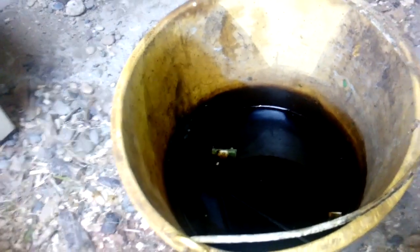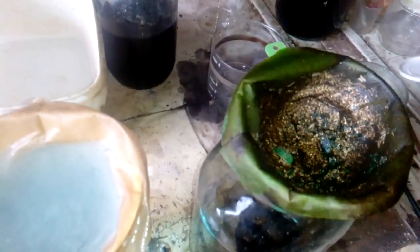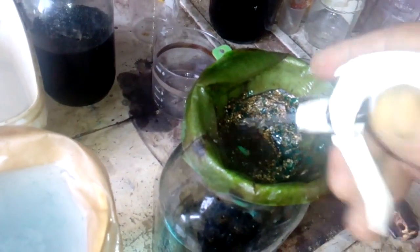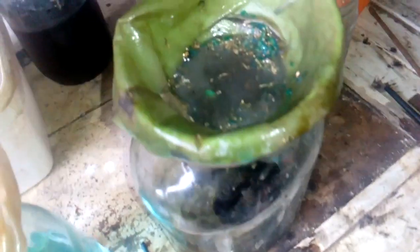Okay, I'm gonna finish. We filter this and we got our foils in the filter. It looks like a lot, but we got a lot inside that green mask. We discard that with a refining process. This is from our rinse bucket - see all that white stuff, some silver, some copper - but we will discard that too. And what we'll now do is rinse that with clean water a couple of times to remove all that copper chloride and all that AP solution.